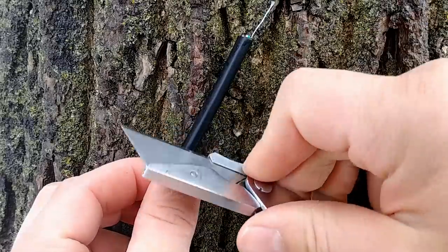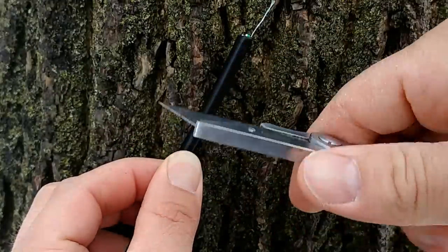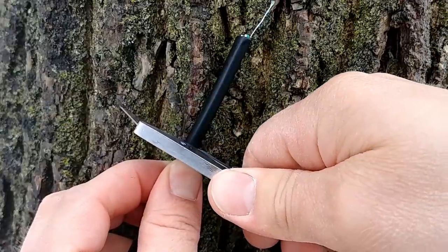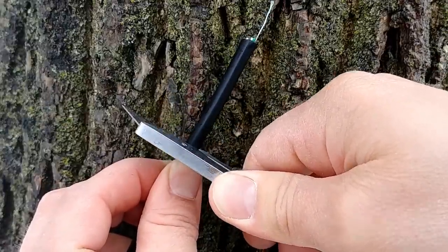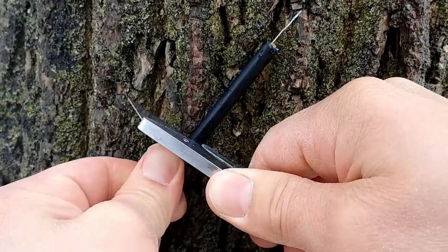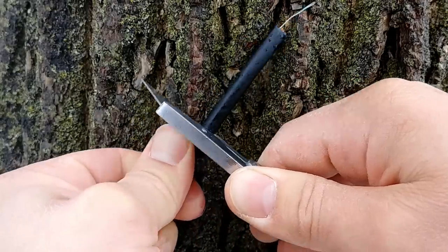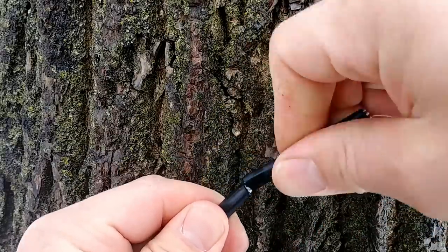If you're looking for a great utility knife, this here is the one I'd recommend — link in the description. It also helps support the channel just a little bit if you choose to buy one, at no extra cost to you at all. What I'm going to do is just score this lightly around the outside edge and hopefully cut through the sheathing by itself. You should be able to just tip it and twist it and break it off.